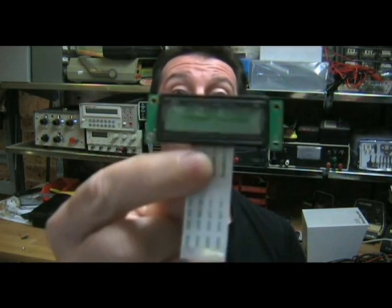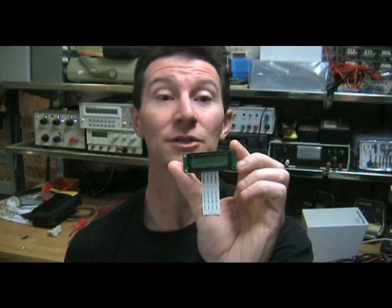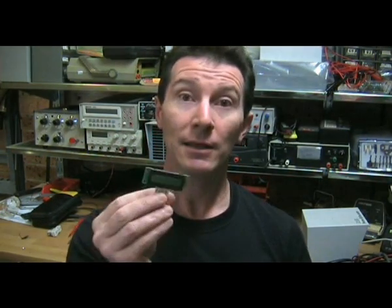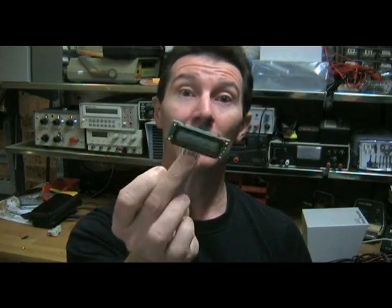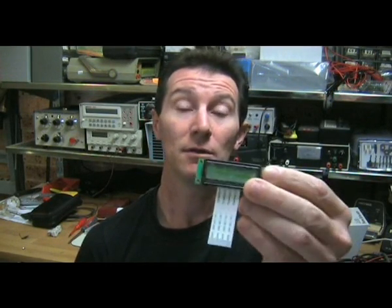I get a lot of questions about my scientific calculator watch project, the micro watch. One of the most asked questions is: where do I get the little compact LCD display? The answer is I get it from Jaycar, but many people don't realize it's an industry standard size — 53 by 20 millimeters, which is really tiny. It's a standard two-line by 16-character LCD display that uses the standard LCD chipset, so it's compatible with your existing code. There are probably four, five, or six different manufacturers that make this exact one with the same mounting holes and dimensions. Look at speccing one into your next project because they're great for all sorts of applications.